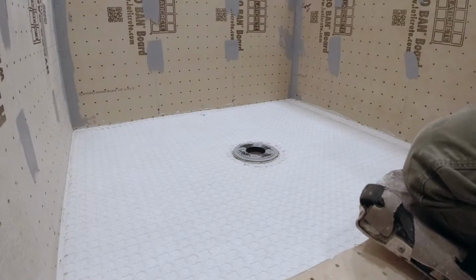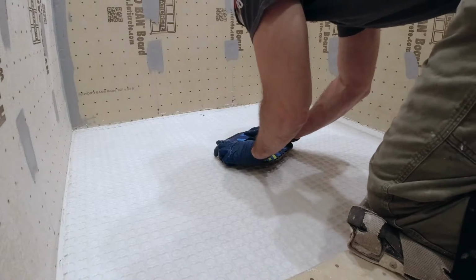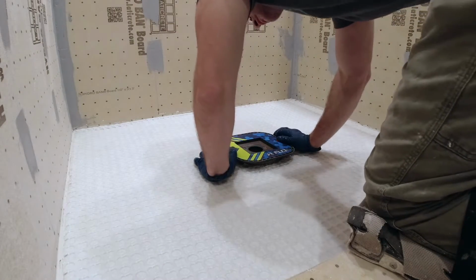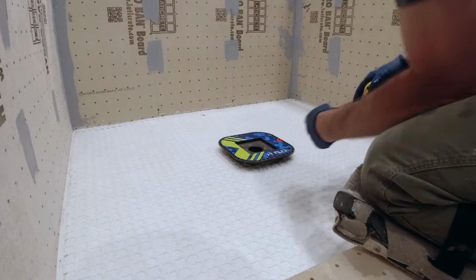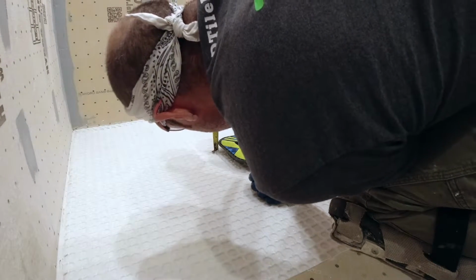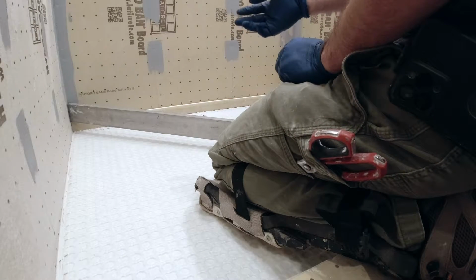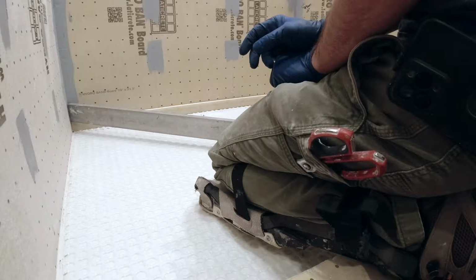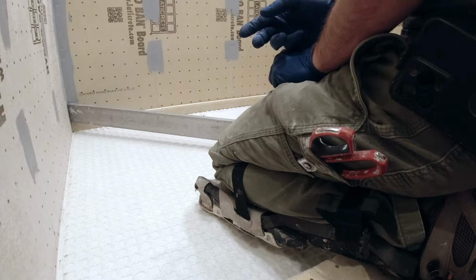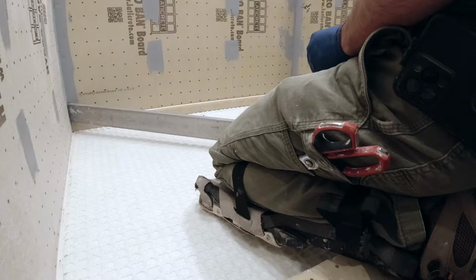Not much room in here. I got the camera, but I'm going to show you what's in there. So with the full effects adapter and all that, I got about 1.25 inches to the top of the flange. So 2 foot 3 inches, which is 27 inches, at 1/4 inch per foot. So 2 feet, that's a 1/2 inch. Then you got basically a 16th. So all we have to do is 1/2 inch heavy.